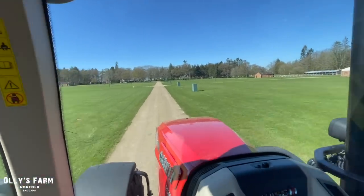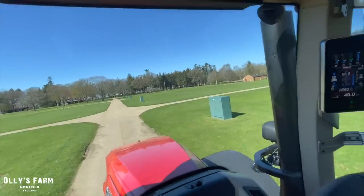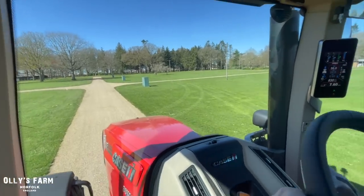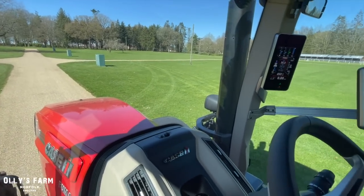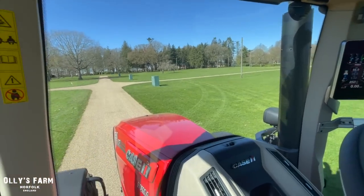And that's it coming up to speed. Wow, that's unreal. So that's your safety mode — see the lights flashing? Because it's above 25k, it's flashing to indicate the fast steering gear isn't working anymore. It's an important point to know. And it's used the engine braking to slow down. Exactly — it just helps the tractor slow down a lot smoother.